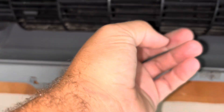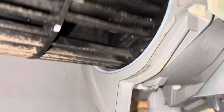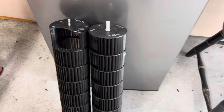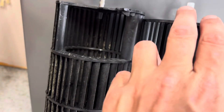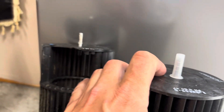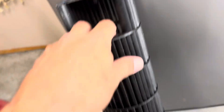Here is our blower wheel — you can see this big chunk missing out of it. I had no idea how that happened. But we can get to our set screw a whole lot easier now — it's right there. We got her out. No idea how this happened — it looks like it probably fell, got dropped, broken some kind of way during service. That is a huge chunk that busted out of there, and it was causing the thing to rattle all over the place. So we got a new wheel here — let's get it prepped to put it in.